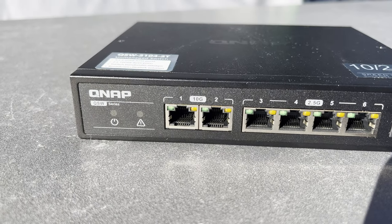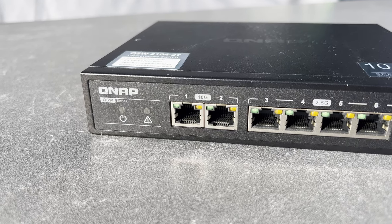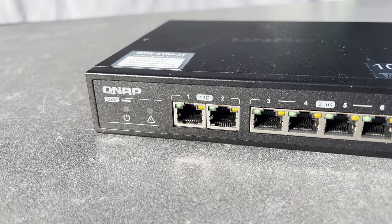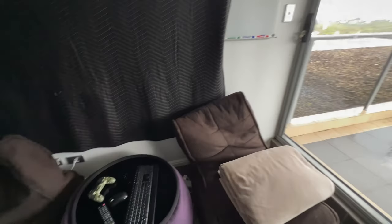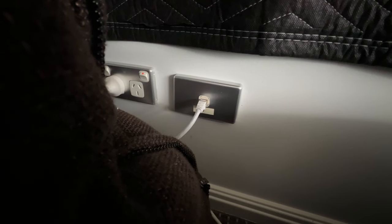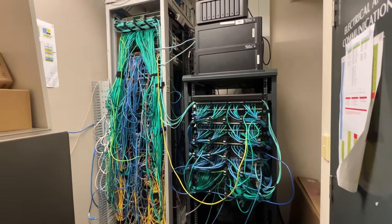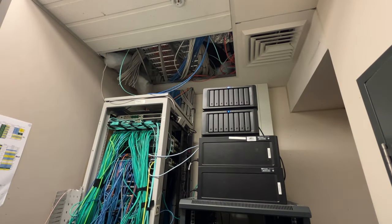Alternatively, if you've got integrated copper interfaces, you should be able to get a bit longer again. To answer the question: can you use Cat5e cabling to run 10 gigabit ethernet? The short answer is yes, and in all likelihood you're able to do it for quite a long distance. For all practical purposes, inside your house it'll probably work without any troubles at all.